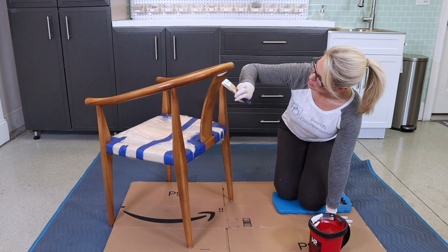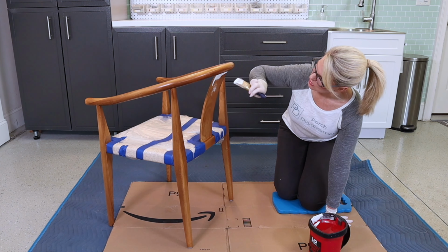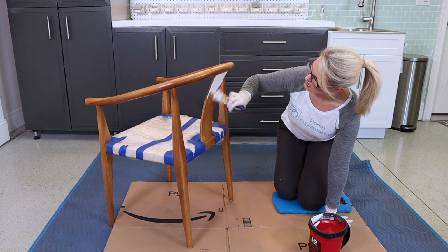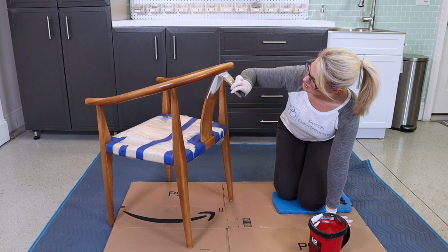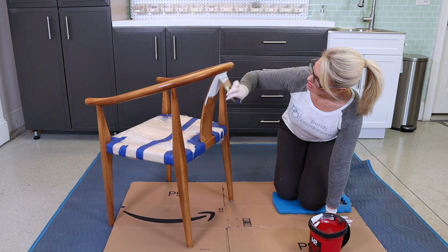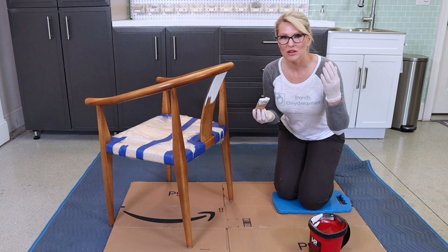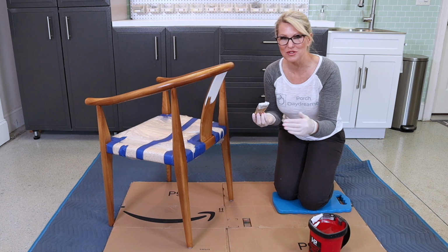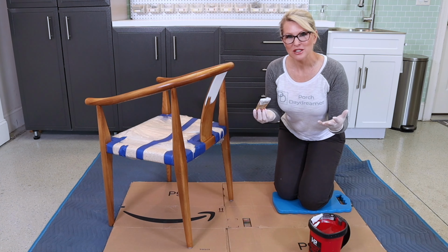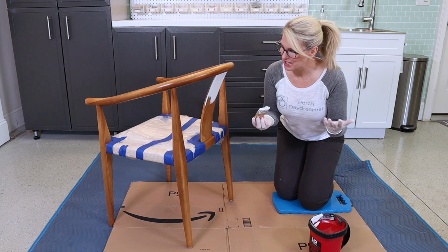And let's talk a little bit about bonding primer. What you want to do with bonding primer, it's really thick and it's very forgiving. So you can see, to get up in that detail area, I'm going across, and then I'm going to brush down like this. Bonding primer is like the super glue for your paint to be able to stick to the surface. I also talk about it like it's peanut butter between 2 pieces of bread. It makes 2 things that normally wouldn't stick together. So I hope that concept is pretty easy.